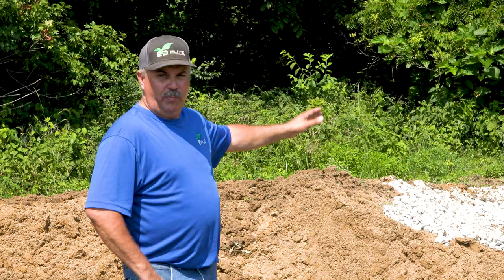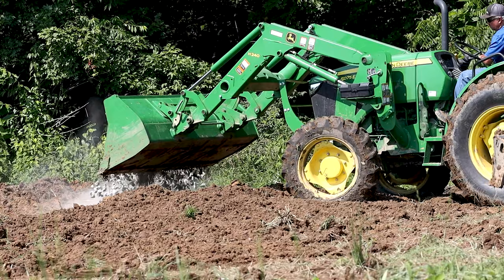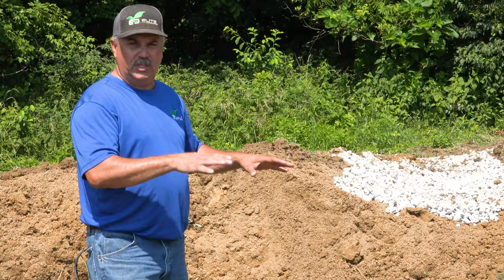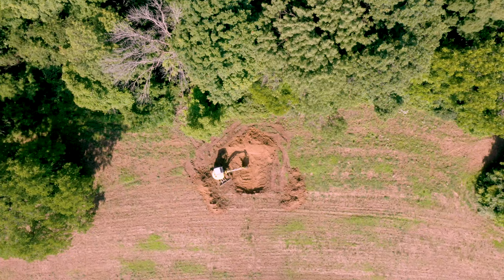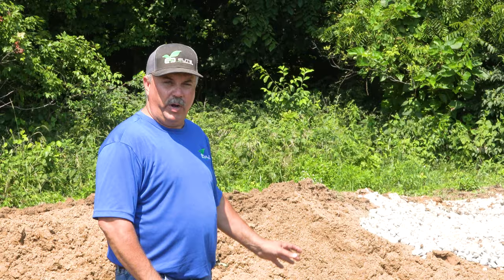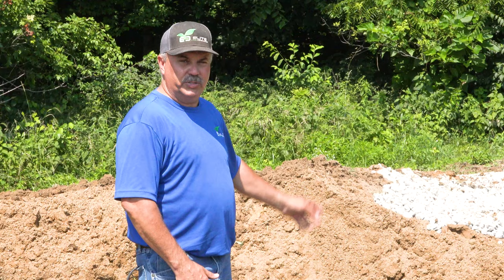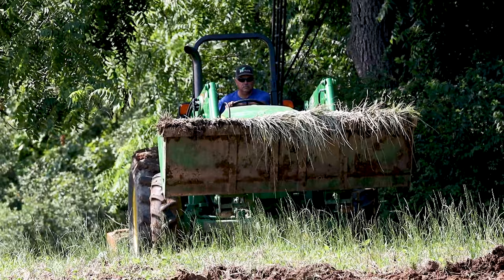What I did is I cut down a little bit on one corner. I don't do it in the middle of the dam or the dike — I do it on one side. That allows the water flow to go to this back corner and not just force out and maybe blow a hole in the dam. I've lined it with a little bit of two-inch rock. This area won't get a lot of runoff, and that's key. If I knew I was going to get a lot of runoff, I would put a pipe in down through the dam and out the back. This area is only going to drain about a three-acre area, so I'm not worried about a lot of runoff — just that little emergency spillway with rock to slow the flow of water where it won't cut a gully in the dirt and wash out the water hole.